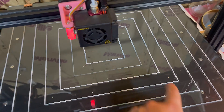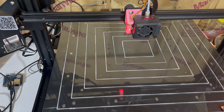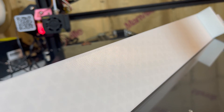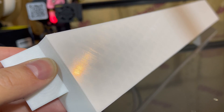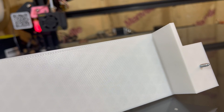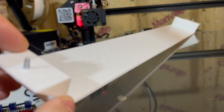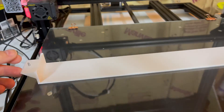In fact, I barely could use this amount of the bed without a significant amount of glue, just to have anything stick — even with the BLTouch and Marlin 1.0. Here is the first print that has come off this machine. I did not calibrate flow at all, I didn't calibrate the extruder, and I did not do any type of resonance compensation or input shaping. The backside — you can see I swiped all the glue that literally transferred onto the build — but it is perfect through and through, all the way across. Really good stuff from Klipper to be able to print this quality. Before, this was never possible.